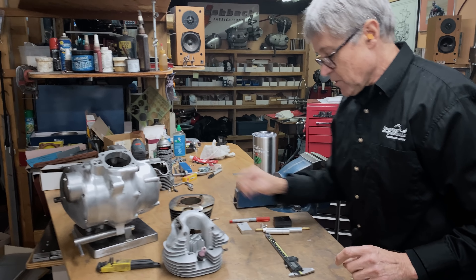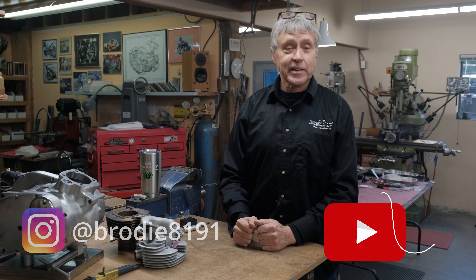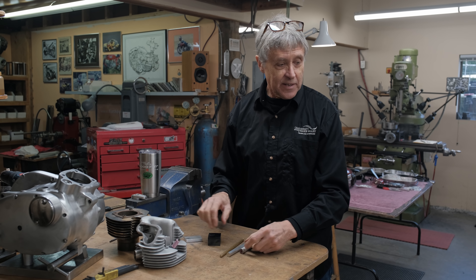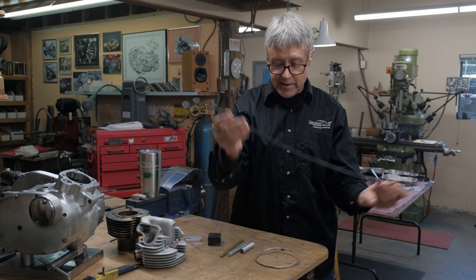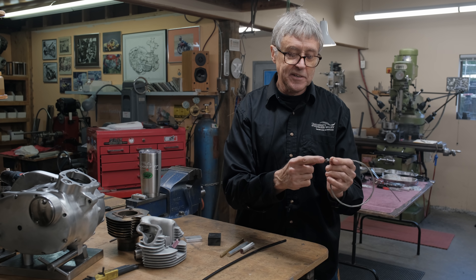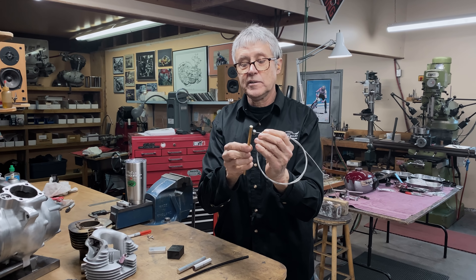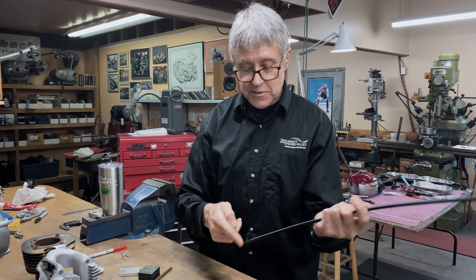So that's some good progress. What we're doing today is we're going to work on the brake cable. I've got a bunch of stuff here — we've got to make ends, things like that. What I'm starting with is outer cable. I've got a piece the right length and I've also got inner cable, but the end is the wrong size. So we're going to make one out of brass and we're going to soft solder it on, and then we have to make all the end pieces.